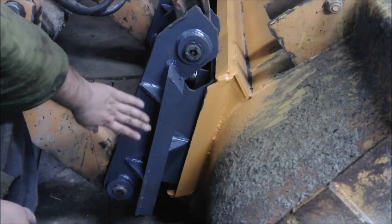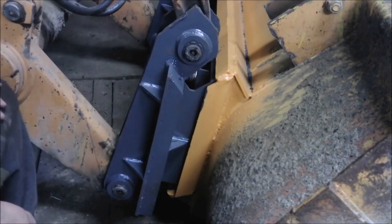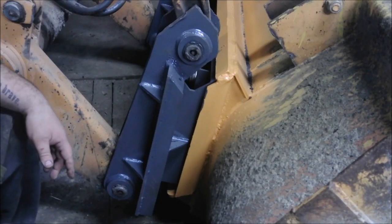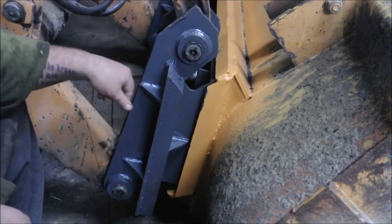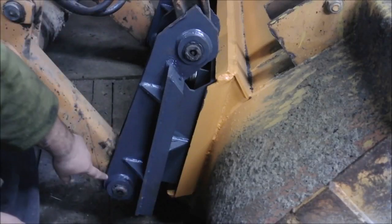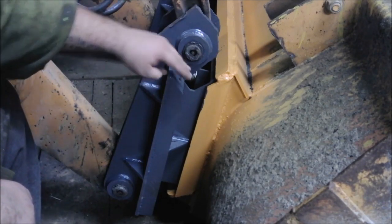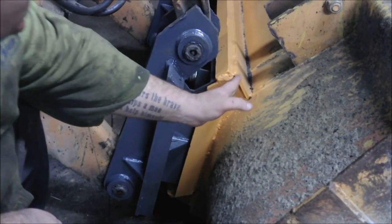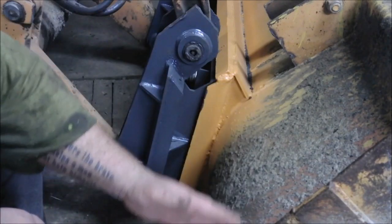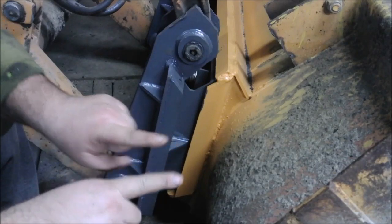Voila, finished product. I really like this gray. I foresee myself eventually trying to get all the asphalt and stuff off this bucket, sandblasting it, painting the bucket gray as well. You can kind of see over here all this tar and stuff — I think we're going to hose this sucker down with some diesel fuel and try and get some of that hosed off with the high-pressure washer. So this is the cut we made — this is the original bracket that fit right here down to here. You can see the cut we made, straight cut right along there. And then we lined it out, made sure it looked just like this so it fit right over that, and you can see that piece is actually still right here. So this guy here would fit right into there. That gave us two flat planes to work with so that we wouldn't change bucket trajectory or the bottom of the bucket so it sits where it's supposed to sit. There's a little knob up there that they line up when you know you've got your level bucket, so that'll all stay the same.